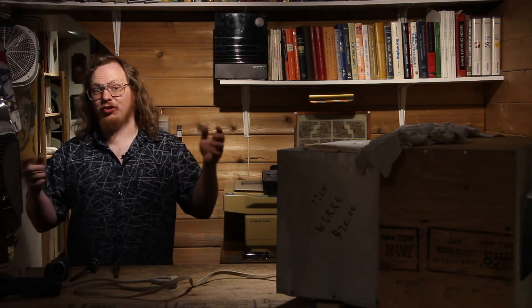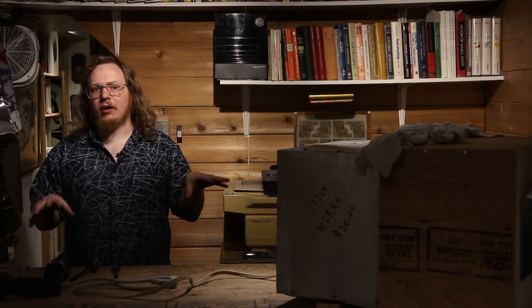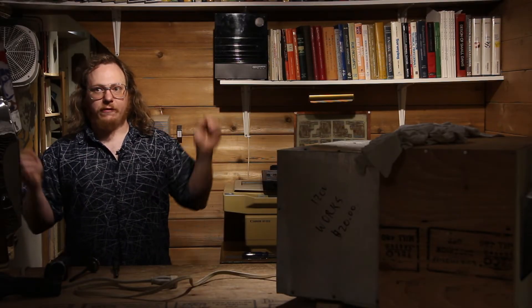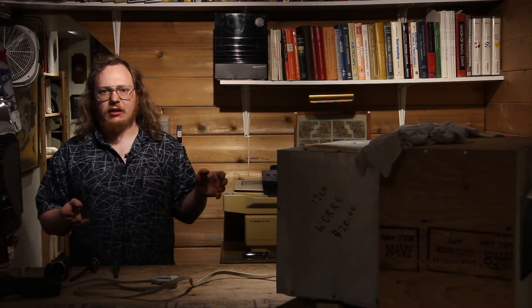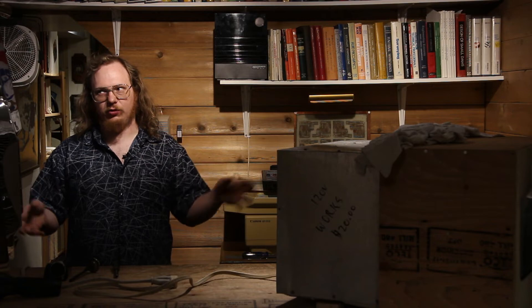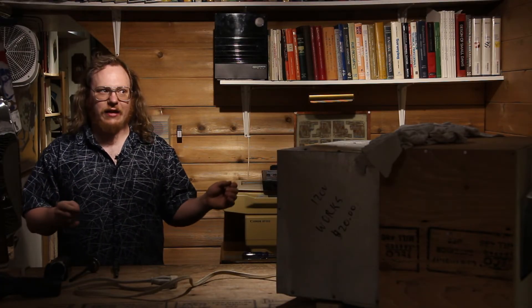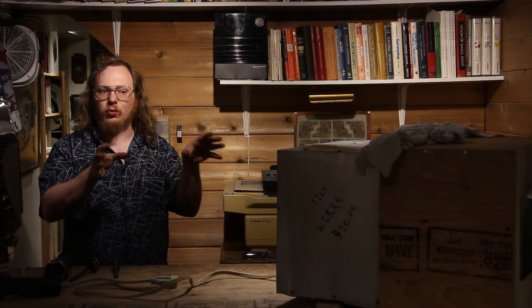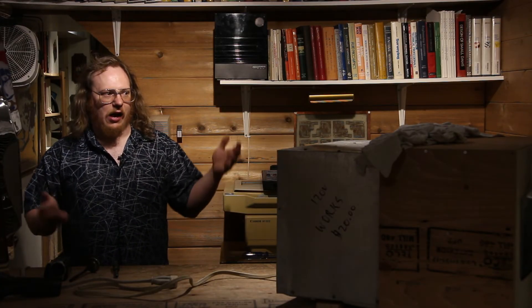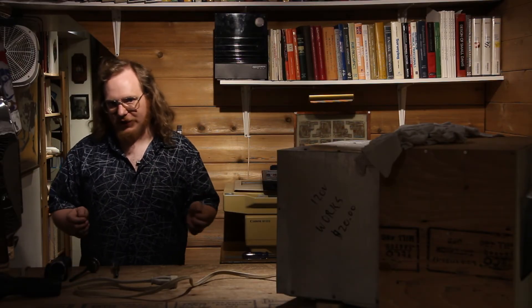My plan was about 70% successful. I've been able to make this air conditioner work inside the house using this enclosure and these hoses, but it's running inefficiently. If anything, you're more or less damaging the air conditioner because the compressor has to work harder, things run hotter, and we're not getting as much cold air out. Now, I've seen a few people ask: can I take a window air conditioner and make it into a portable air conditioner? My final word is: as long as you can get your air ducting to be sufficient for how much heat it's throwing out, yes, you can make this work. That said, Technology Connections has already made a video pointing out that having just one line and using the cool air in the room to help cool off the air conditioner is a bad idea — go watch his video. I'm just going to have to refine this a little bit more, but it looks a little ridiculous, it smells like chemicals in here, and I hope you enjoyed watching this.